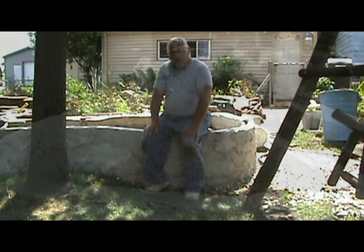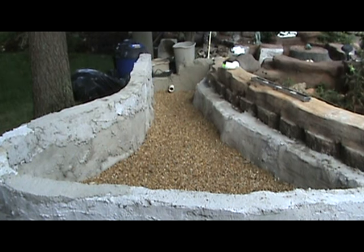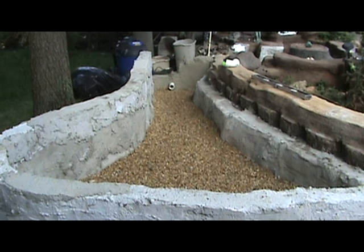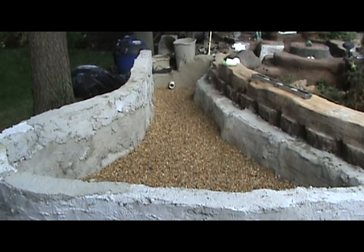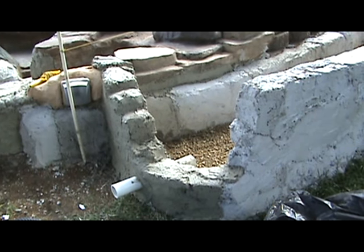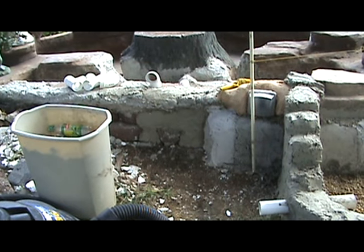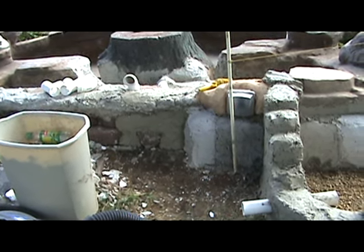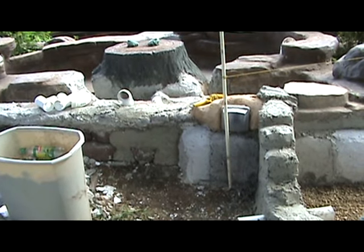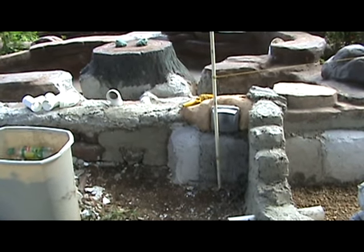And also put in a drain so that I can — here we laid down a layer of pea gravel in preparation for doing the floor of the pool. I started the end wall. The pipe in the bottom is going to be a drain so that we can drain this out to clean it. We have the hole that was knocked in the wall now repaired. Water pipe comes from the stump back there to the outside here and then along the wall.